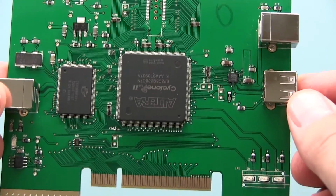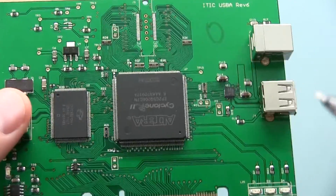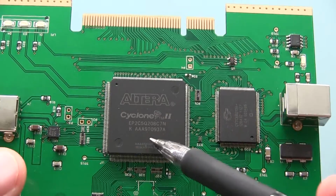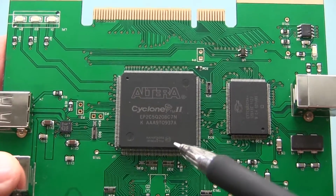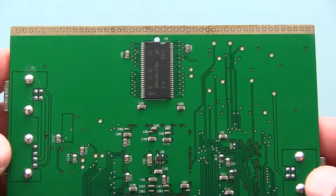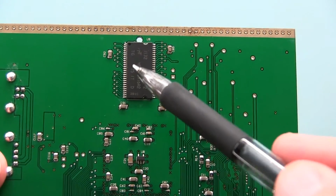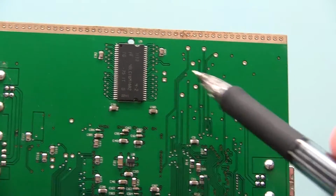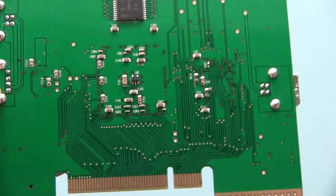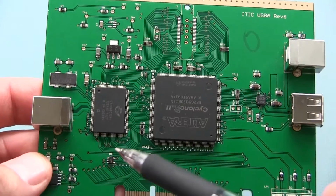So as you can see, it's quite a simple hardware design of a USB protocol analyzer, but of course the complexity is all about what's inside the FPGA, and it's actually quite complicated to accomplish everything that goes on here. The 1480B USB protocol analyzer, which is the next version of this one, will have essentially 4 of these SDRAMs underneath here, 64 megabytes each, for a total of 256 megabytes capture buffer. Apart from that, the design is expected to be fairly similar to this one.